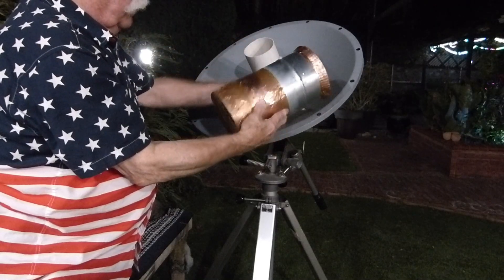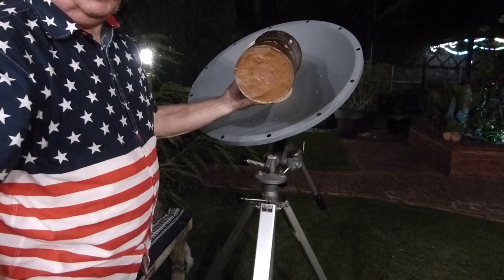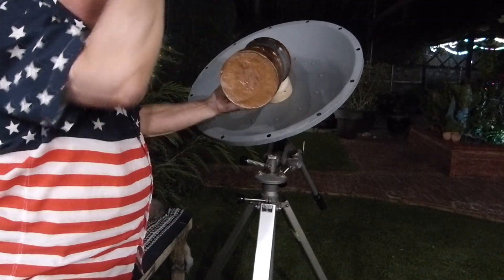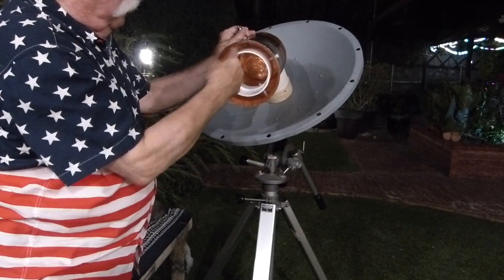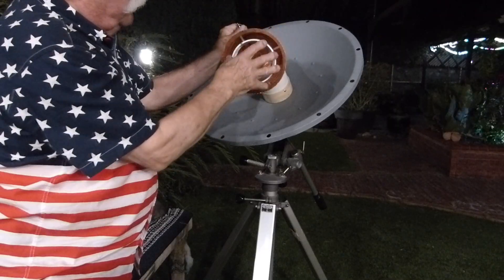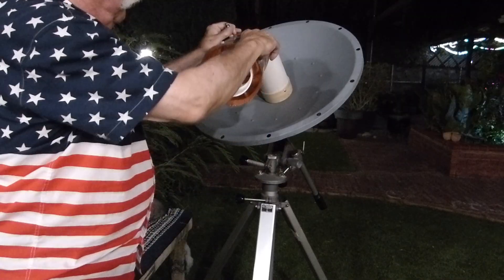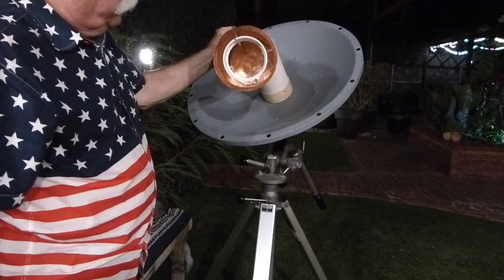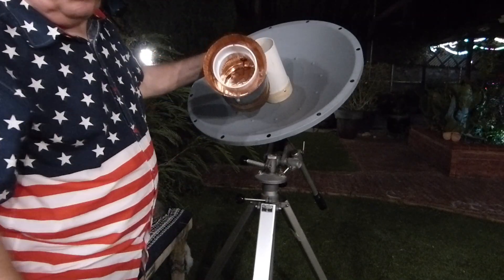I use copper tape — makes it look kind of cool. This is the open end, which is just covered in copper tape. This end is flared a little bit. This is PVC mounted in there with nylon nuts, so this just holds it — it's invisible to the RF. It's flared a little bit; I don't know if that helps or not, but ChatGPT said it did. It's got a quarter-wave probe on the inside.